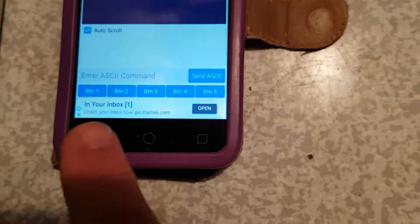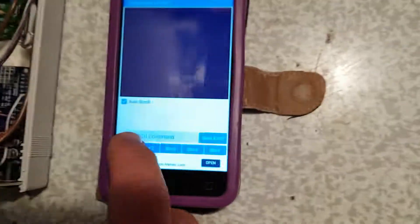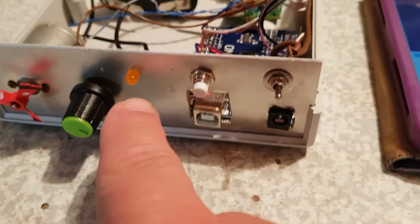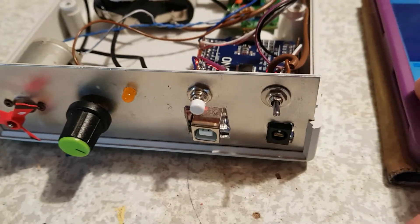We're going to this program called Bluetooth Terminal, which is a greatly simplified version of what we're going to write in BASIC. At the moment I have a terminal that says connected, and this terminal has got some buttons which I've already programmed with text commands. What I've done with the Arduino is have it just reading individual characters. The LED at the moment is off — so if I press button 1, it transmits the ASCII code for character 1 and the LED lights. If I press button 2, we get ASCII code 0 and the LED is off. Button 1, button 2, button 1, button 2.